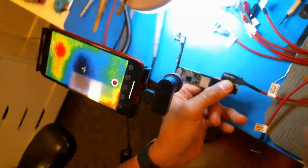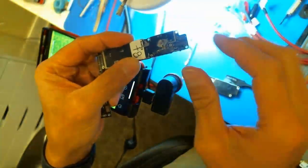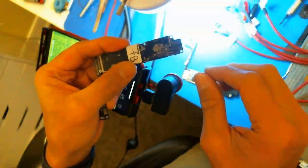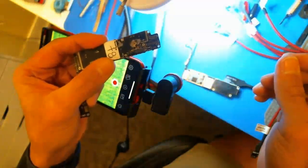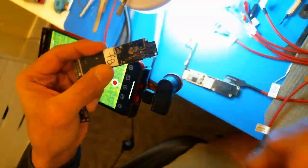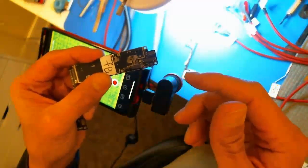Let me show you on the board. The battery connector is missing here, but there are two I2C lines. They should read right around 0.74 volts in diode mode, and the other one should be right around 0.4 volts. One common problem with these 8 Plus boards is the pop-off transistor, but that wasn't the case on this logic board because the two I2C lines measured fine.